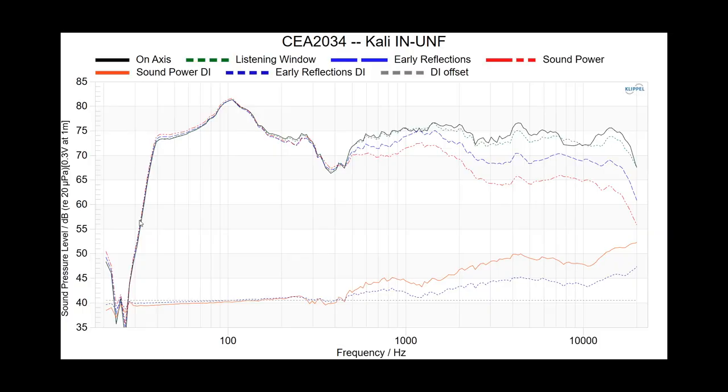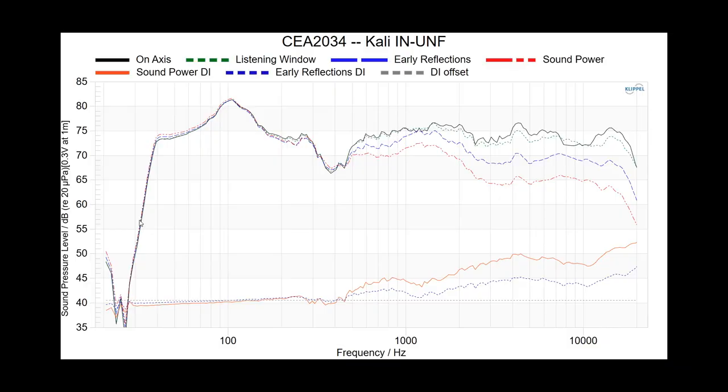Really, this is just done to give us an idea of the directivity of the particular speaker and the bass unit together. Not so much to understand the linearity of the response, because again, for the 15th million time, I measured the speaker anechoically, not sitting on top of a desk, and it was designed to go on top of a desk. But the cool thing about this data is that it still gives us a really good idea of where the crossover region can be, and more importantly to me, the directivity index. So if we look at the directivity index, as long as it's linear, it can be flat or it can be rising, but as long as it makes a line shape, then that means the speaker can be EQ'd. For the most part, the speaker can be EQ'd.